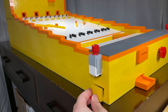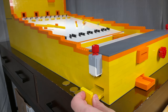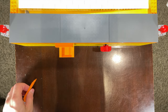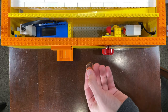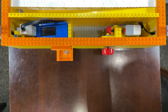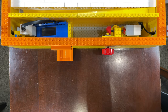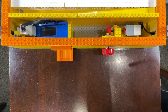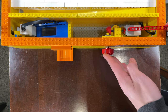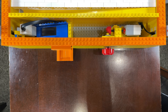The first feature is a tray on the left side that can be opened to get the quarters out. The second feature is coin rejection — coins smaller than a quarter just fall through the hole in the middle of the blue piece. Another thing you can see from this angle is that the touch sensor is being activated from a 90-degree angle. I needed to do this because the touch sensor was too long, and if I mounted it vertically, it would hit that yellow wall.